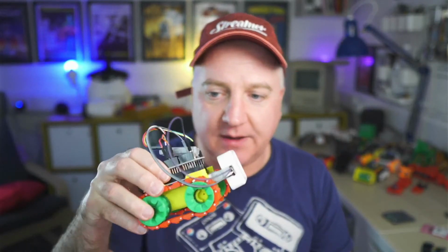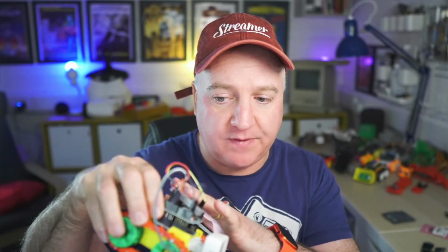Dabble is an app that you can get for your mobile phone, and there's a really nice gamepad option on that, and you just need to connect. For example, this robot that's got an Arduino on it has the Dabble library on there, so it's waiting to receive commands, and I've set that particular one up so when it receives an up command, it knows how to roll the robot forward. So I'm not sure what's going on there. I do know that Dabble works with MicroPython. I'll have a look at that.